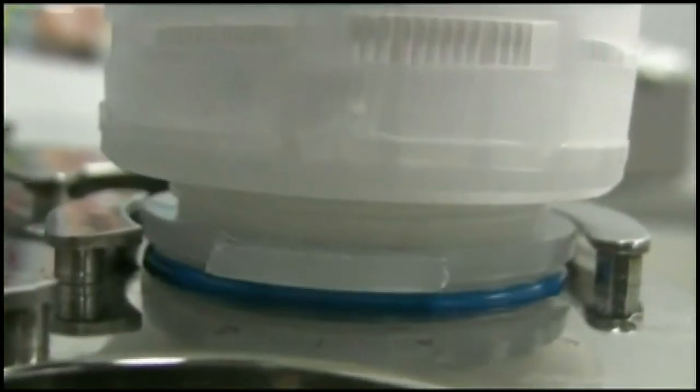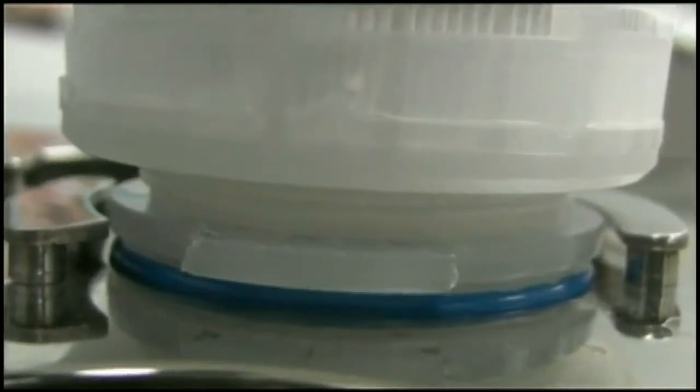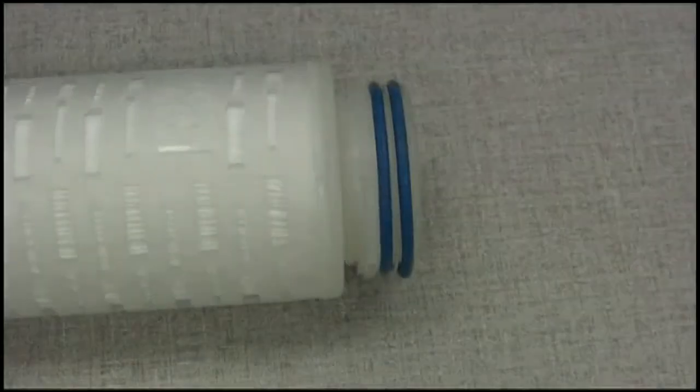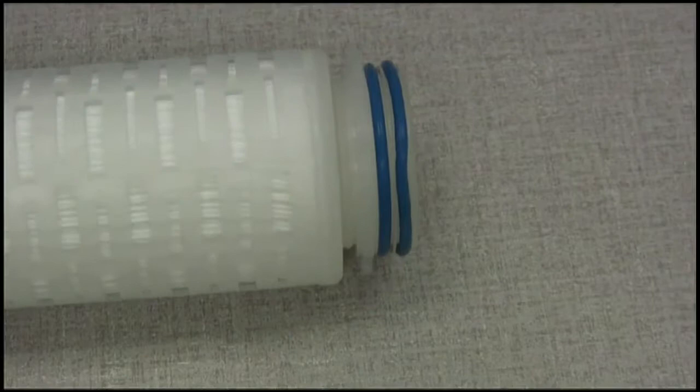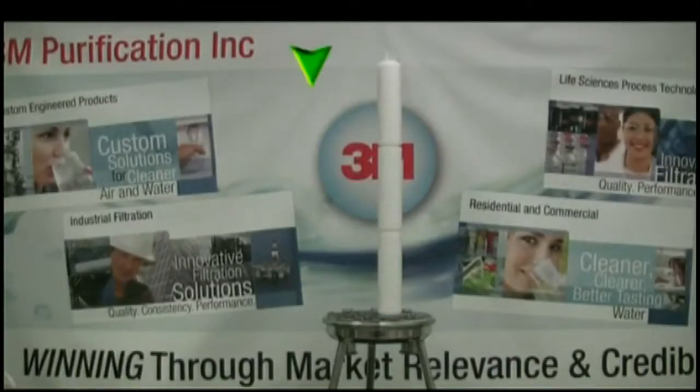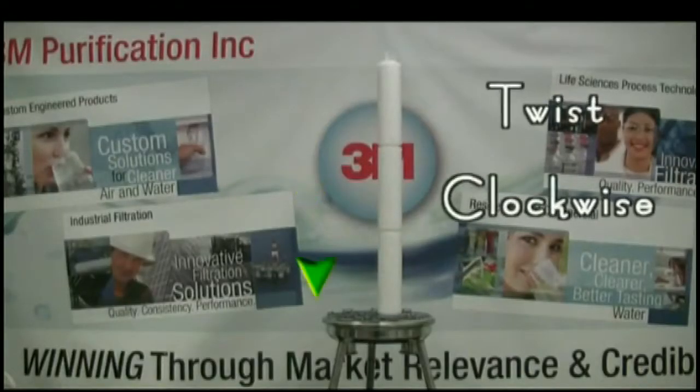If the majority of one or both O-rings are visible, the filter was likely maintained in the perpendicular position during installation but has not been completely lowered into the receptor. If this is the case, check the O-rings for physical damage or geometric deformation of their natural circular shape and replace if required. Next, re-wet the O-rings, line up the filter, and when exerting downward force, add a slight clockwise twist. This may assist in lowering the filter into the receptor.